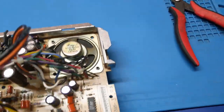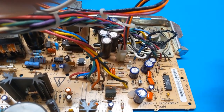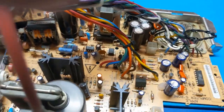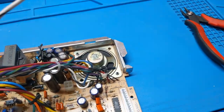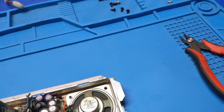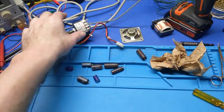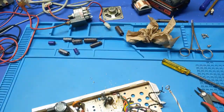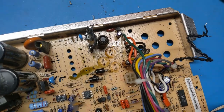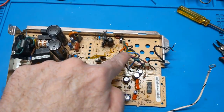I'm probably going to have to drill that speaker out. I'm going to have to pull this speaker out because I've got to wash this board — it has to be washed because I can't have this cap juice everywhere. So I've got to pull the bad caps off and then wash the board. This definitely qualifies as disgusting. I took the flyback out because I don't want to get it wet, and I took the transformer out because I don't want to get it wet either. This thing needs washed something fierce — this is disgusting.